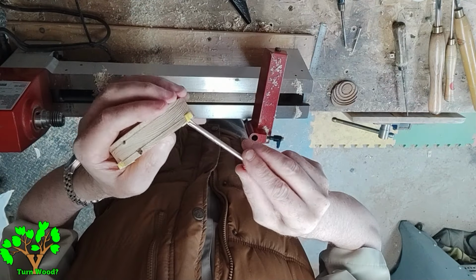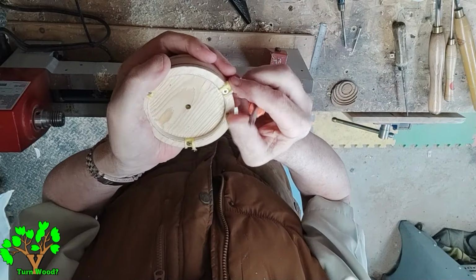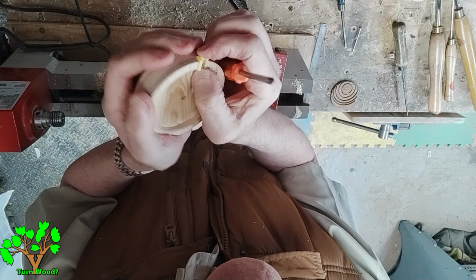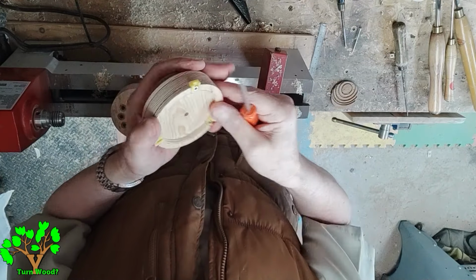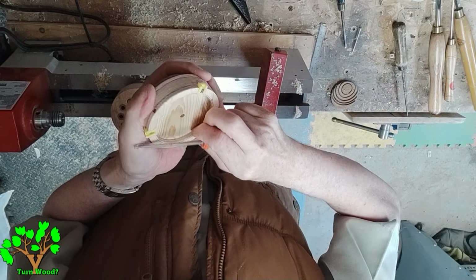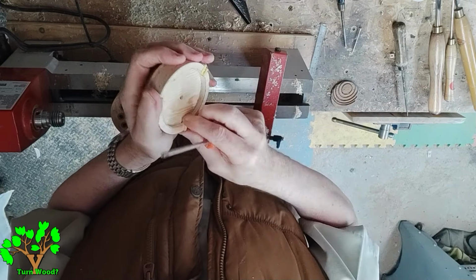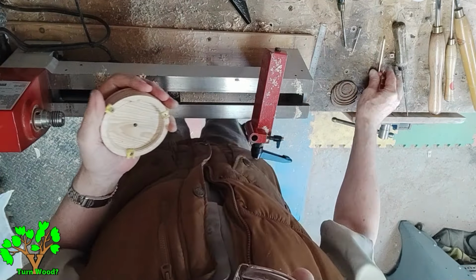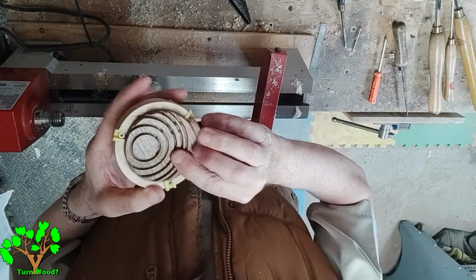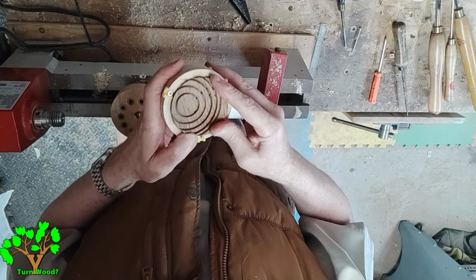As you can see, I put 3 notches in the perimeter of the end cap and put some plastic packing pieces that I could adjust and hold the pendant blank if it was a smaller diameter than was required, so it would still centralise it. But it didn't work too well, and instead I just used the recesses where the plastic packing pieces went to prise future pendant blanks out of the recess.